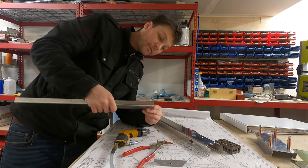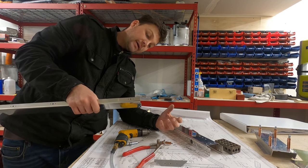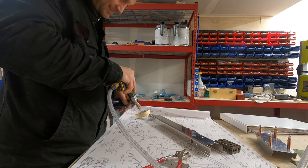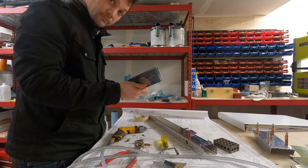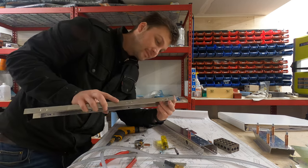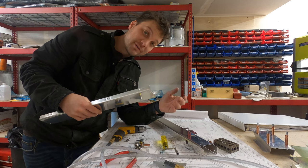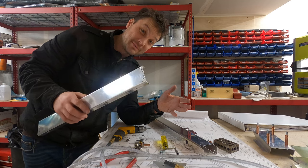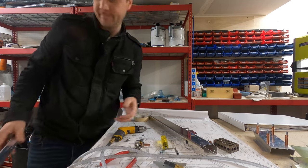I will also note that I'm not overly concerned about edge distance on nut plate rivets. They are really there more for alignment and just to hold the nut plate on. It works. It's not my best work, it's not my proudest work, but it worked. I think it'll be fine, and you'll never be able to see it. That's the best part, except for I just showed it to you. Other than that part, you'll never be able to see it.